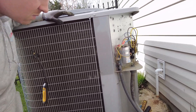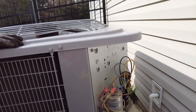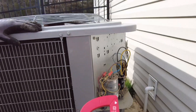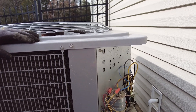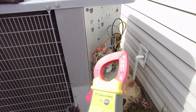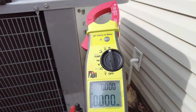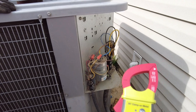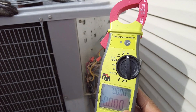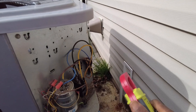Let's see if our non-invasive capacitive check is accurate. You can check a capacitor without actually pulling it from the circuit using this meter — you can use virtually any meter as long as it reads volts and amps. We're going to measure our power factor. A power factor above 0.95 usually means the capacitor is within tolerance; if it's below 0.95, it's typically a weak capacitor.